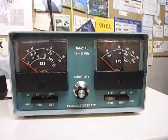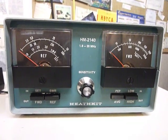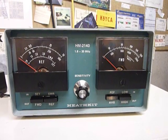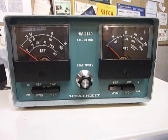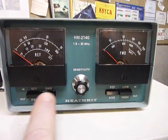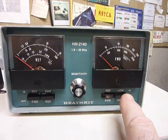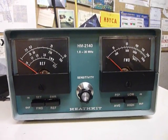I really enjoy it. I've got this HM 2140 — it's a two-meter SWR power meter. It has a circuit in there that averages your single sideband signal and shows you the peak of your sideband signal, which is really nice. It also has a standard SWR bridge which you can select over on this side, and over here is the circuitry to do the peak PEP.